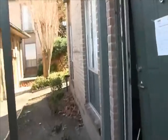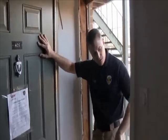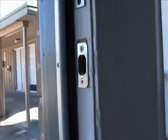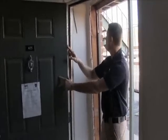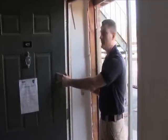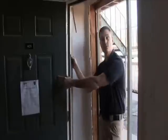Three-inch screws — still in there. Doing these experiments is actually quite interesting. We always recommend the three-inch screws, and you can see they held. In this case, however, the door is still attached to the frame — the frame is just no longer attached to the stud here. So one thing we've just now discovered is to attach this door frame to these studs with longer screws.